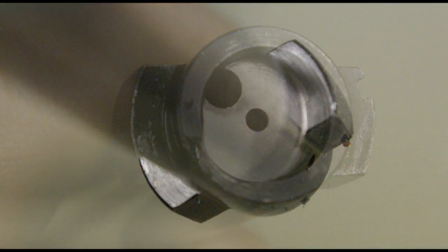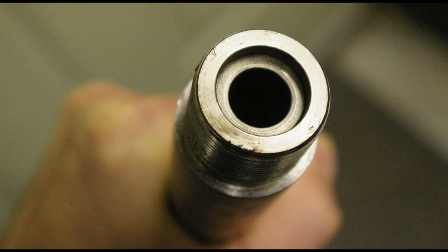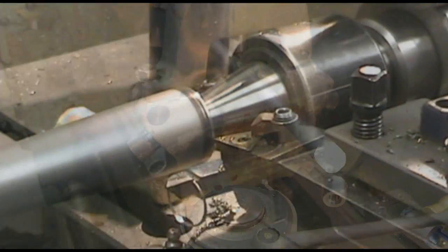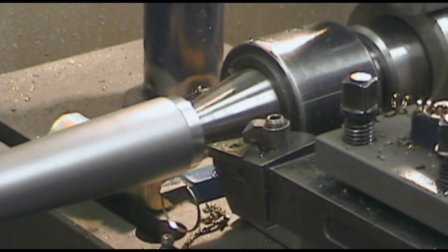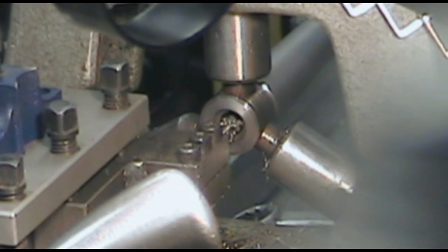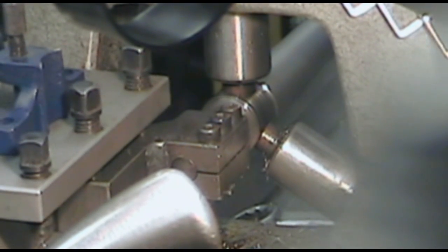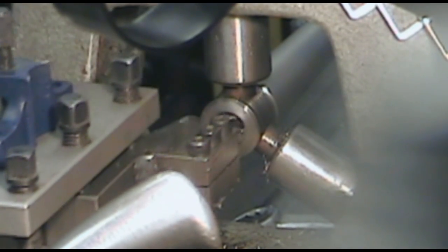Normally this would be the time where you'd screw on a new barrel, but since my new barrel is still on order, we'll just have to true up the old one. We want to move the chamber forward, so he started by lopping off the old threads. Next, he trims the circumference of the barrel to create a flat surface for the steady rest to ride on. A drill bit is used to cut the chamber to a rough, undersized dimension. He then enlarges the hole with a cutting tool, creating a chamber that is just slightly smaller than the correct dimension. The chamber is now ready for the reamer.